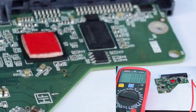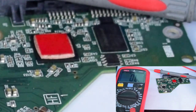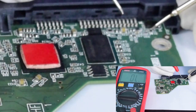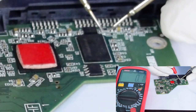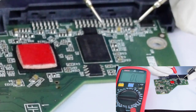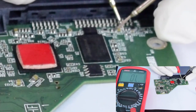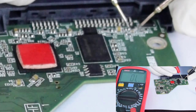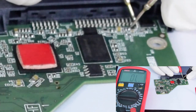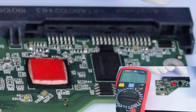I am switching my multimeter to the diode range or beep range and testing the resistor. It might be a one-ohm or zero-ohm resistor — you could call it a jumper. The capacitor is okay. But this other resistor is not showing any value — and these two resistors are working as a fuse to protect the entire circuit. So let us change this.